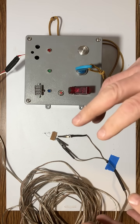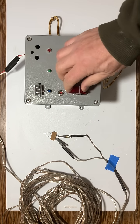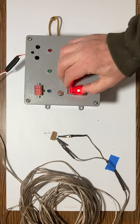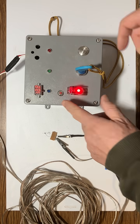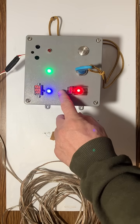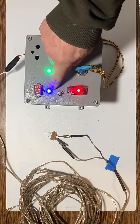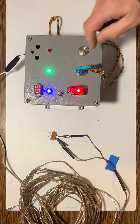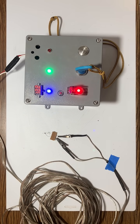So assuming I've gone to the rocket, put the igniter on, and made the connection, I'm going to come back and turn the power on. In this case, from the previous situation, the breaker had cut everything off, so I need to start the controller by pressing the breaker reset. Now you can see that the breaker light is blue, indicating that it is pulled in. Continuity is green, indicating that we do have continuity through this igniter.